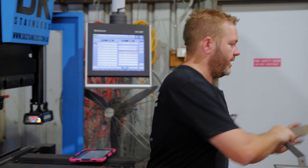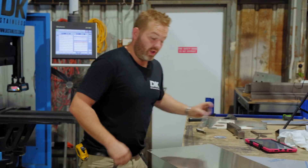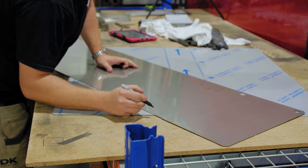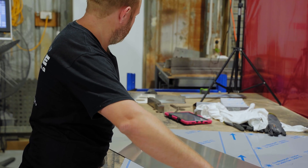Our straps are now complete. Now we're going to work on the body of our tank. Because some of the sides on this tank have a long flat surface, if you put a little bit of pressure on them they bow out. So what we do is go through and cross break our larger surfaces — it just gives that nice flat surface a bit more strength and it's less prone to bowing from pressure as the water expands and contracts. On this one we're just going to mark out where our cross breaks are going to go — it'll make it a lot easier when it comes to lining this up. I'll also double check to make sure I've got enough die in the machine.